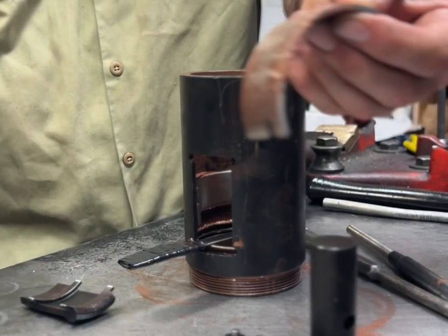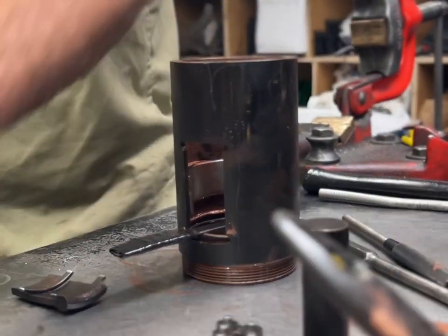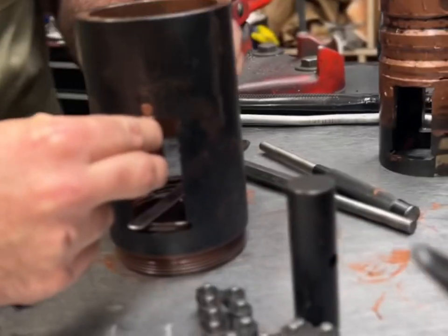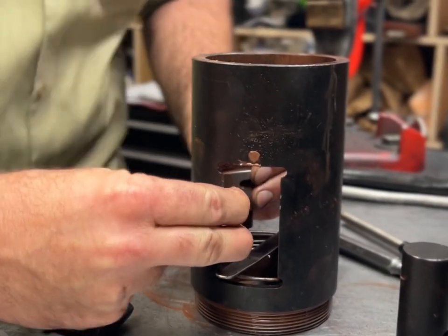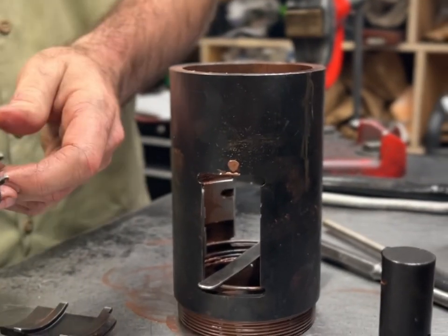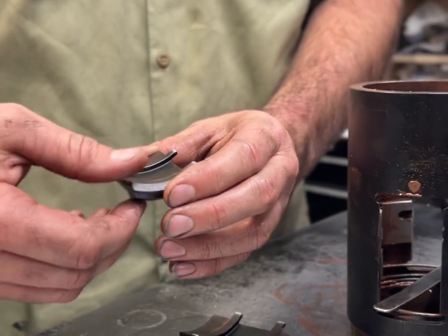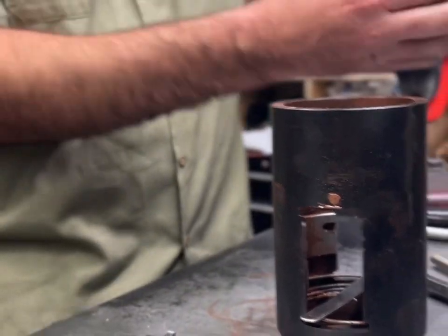Basically, the grease is to hold it in place. Dab you a little dab in the middle, or on each side. And when you slide it in there, you just place it and press both sides, it'll make a suction to the wall. And then you take these, and if you ever buy new ones of these and you have to replace these, make sure there's not sharp edges. You just buff them smooth and round so it slides, because this will slide on the mandrel. So you don't want it to be sharp.